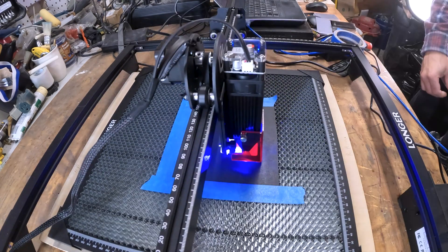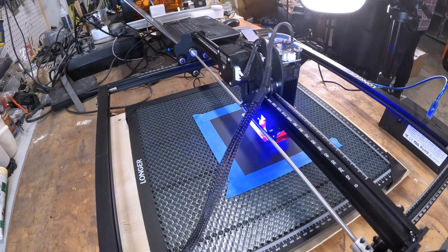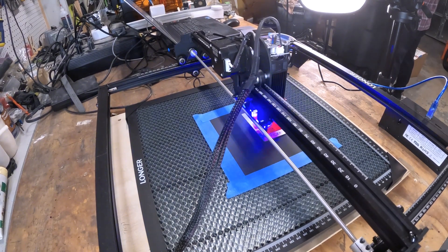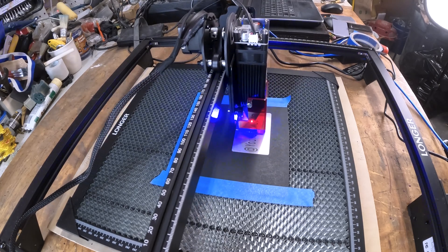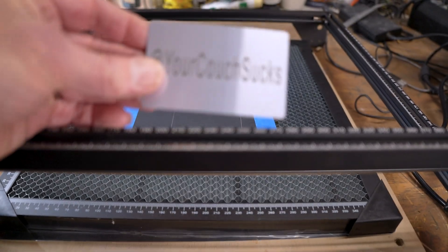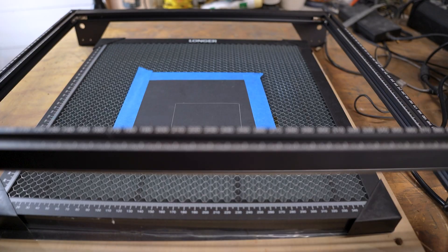This is going to be a lot slower to actually get the engrave on a stainless steel card that isn't anodized — you have to go a little bit higher power and slower. For this, I'm doing 500 millimeters a minute for speed and 75% power. And that's text on stainless steel. Truthfully, with the anodized cards or stainless steel cards, diode lasers do work, and this Longer Ray laser is pretty impressive. To do a lot of those, you're going to want to move over to a fiber laser, but this is not a bad way to go with the Longer Ray 5 10 watt.